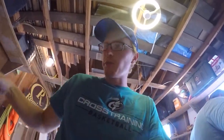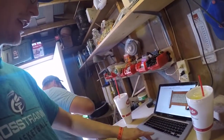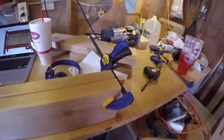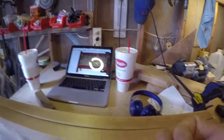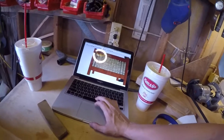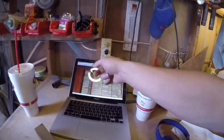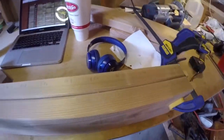We've come to the part where we're marking up this board. As you can see, we had to refer back to our drawing right here. SketchUp has a measuring tool and it showed a quarter inch from the edge of the board as the starting point. We tried to figure out the lines on the fly first but it didn't quite work out, so we went back and took the measurements that SketchUp actually gives us. We zoomed in, put the tape measure on one side, strung it all the way across, and marked the outsides of the slats.